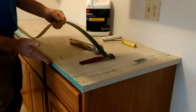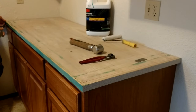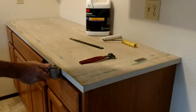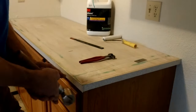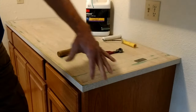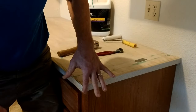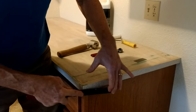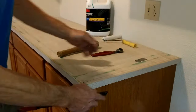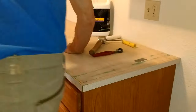Once our piece is dry, check it by hand to make sure there's no transfer. Clean off the end — make sure there's no excess glue against the wall, much easier to clean off ahead of time. Working from one end to the other, put the self edge on flush to the bottom edge leaving a little overhang on top. Roll it really well, nip it off. When we file it we're filing against the face, so angle the file out a little and take it slowly. Check it by hand, give it a finish polish. The underneath side is a sharp edge — this is a working area so we don't want anybody cutting themselves. Hit it with the flat side of the file, then the outside corner to smooth it off.